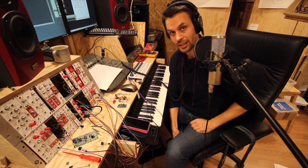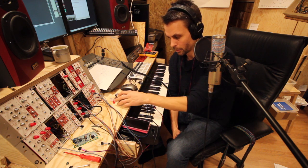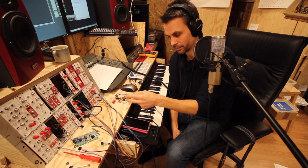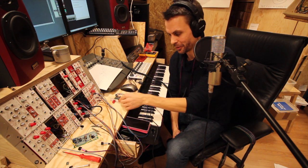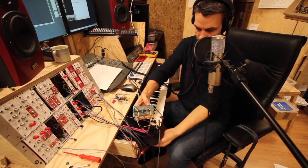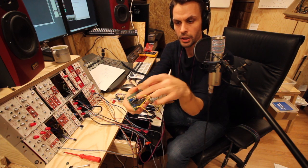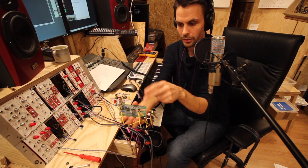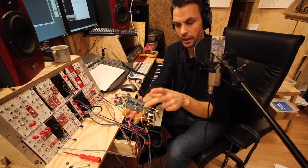For that reason I sat down yesterday and tried to tune this one and connect it, but because of the way this is already built up and this one is a working module, I really didn't want to put it back in there. So what I did instead is I sat down yesterday and built a whole new one — a completely new one on my own protoboard, which I've done a couple of times before. It's much more organized, with the input summing mixer, the exponential converter, and then the oscillator core.